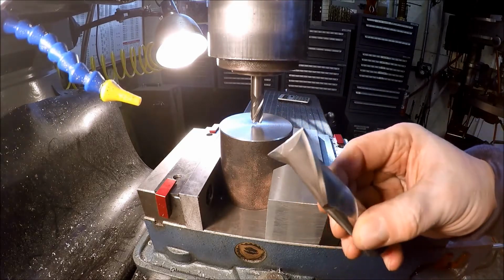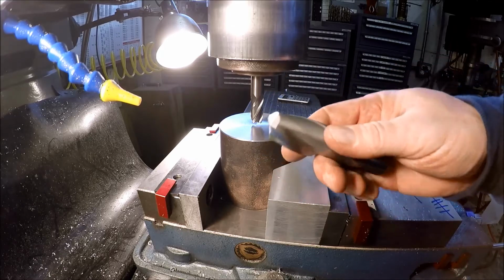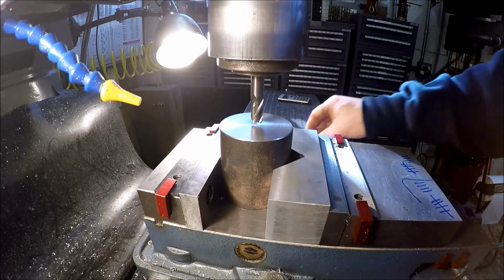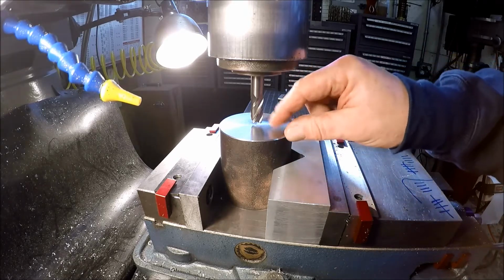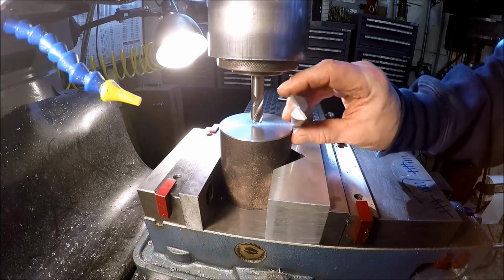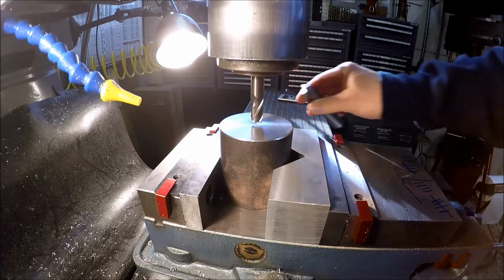it's close to a 1 inch. It's a regrind. A buddy of mine gave me a bunch of these, so hey, big fat end mills that are free are always good. So then we'll come back, and then we'll just plunge that down to 100 thou, because even though it kind of looks like it will center cut, I'm not 100% sure, so don't want to make it work if it don't have to.